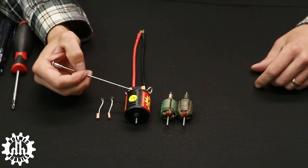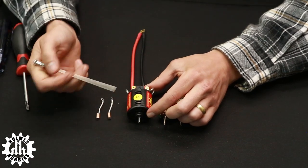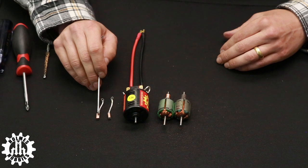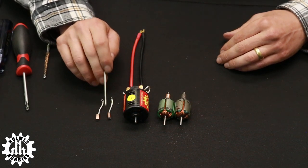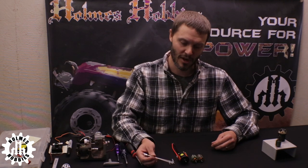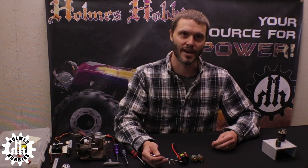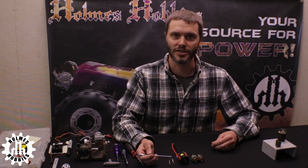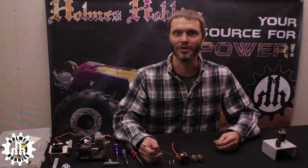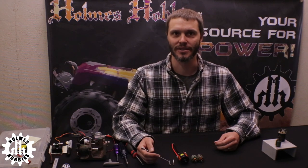That covers the basics of brush motor rebuilding. We cut the commutator to a new fine finish, reinstalled the armature with shims in the appropriate location to avoid crashing on the top or bottom of the can, and ensured brushes were of proper length — no less than 5mm on our brand lines before replacement. We reinstalled the brushes, broke the motor in at 3 volts for about 3 minutes, double-checked rotation direction and timing for faster forward rotation, and now it's ready to install. For questions, email or call us through holmeshobbies.com, like us on Facebook, subscribe on YouTube, and subscribe to our newsletter.